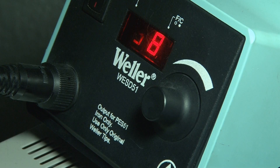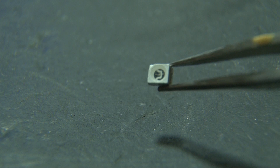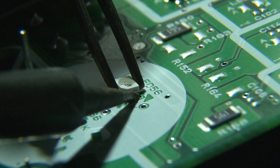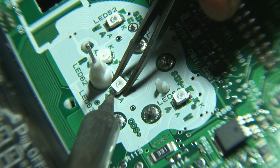I'm going to be replacing those plain white ones with these super bright blue SMD LEDs. They are tiny, but put off a super bright blue light. So I carefully heated up the solder under the old LEDs, released them, and then added a little bit more solder to each of the pads. Then it was just a matter of lining up the new LEDs, making sure the negative notch is in the correct place, and soldered the new ones in place.